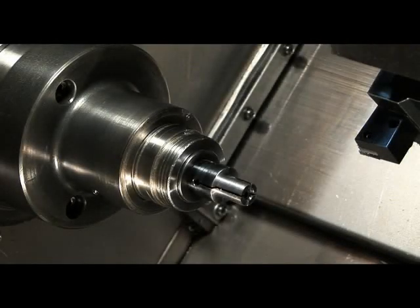After your finished pass, actuate the draw tube to the forward position. Slide your part on and actuate the draw tube so that it pulls the screw back to expand the collet. Make sure that the part is secured on the expanding collet, then release the screw by bringing the draw tube to the forward position.